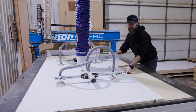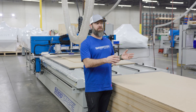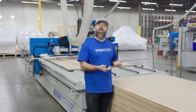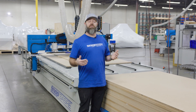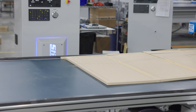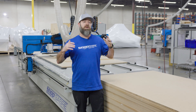For a third option, we've got a hydraulic table. One of the benefits here is you can grab your forklift, set a whole bunk of material on it, and paired with any machine you can use a foot pedal to lift it up to the height you need and slide it right onto the machine. In this scenario it's paired with our ISA - everything's automated. The gantry will come back, suction cups lift the sheet up, pull it onto the machine, cut everything, and after it's finished cutting it slides onto a conveyor belt. All you've got to do is be on the other end unloading your parts.